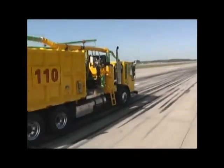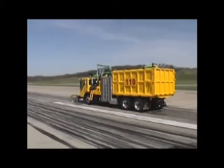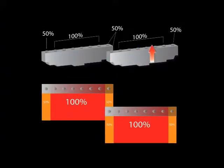Notice the overlap is far less than the 8 to 12 inches required by our lateral machine. How is this possible? First of all, the vehicle is traveling very quickly when compared to a lateral movement machine. Secondly, there are no scalloped edges left by the machine as it travels in a straight pattern. To make this truly understandable, you need to understand something about the blasting pattern and the circles in which the spray bars are moving in. There's jets all along the continuum of the spray bar, but the jets at the outer edge of the spray bar are traveling at a much faster speed than the nozzles on the inside of the spray bar. And what we do to mitigate the overlap is we put a diameter in the outer nozzles, half the diameter of what they need to effectively clean the surface, so that when the nozzles overlap in the middle, they're effectively cleaned only once, not twice.